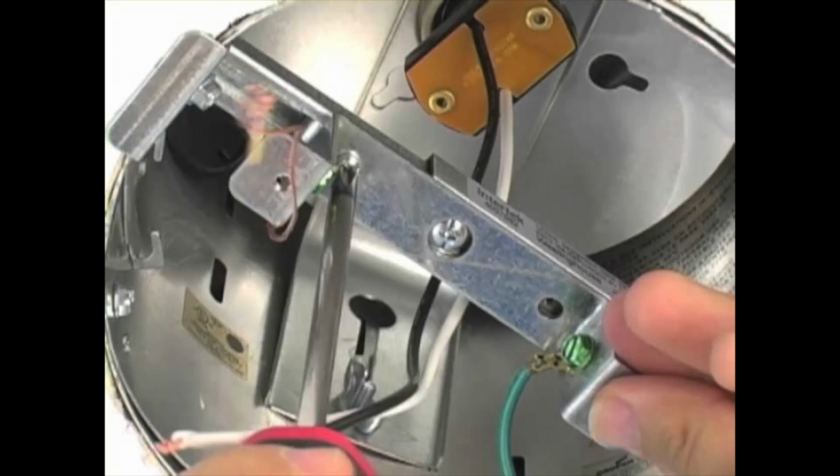So if you're lucky enough to have an adjustable pot light box, then you can bring it down. You bring it down 1/2 inch for the resilient channel, and then depending on if your drywall is 1/2 inch or 5/8 inch, that will determine how much more you bring it down. Now, if you put another layer of drywall over top of that first layer of drywall, you'll have to bring it down another 5/8 inch, just so everything is flush when the job is done.